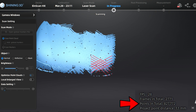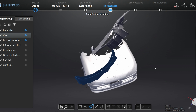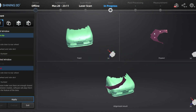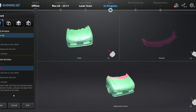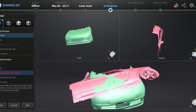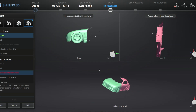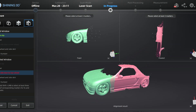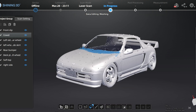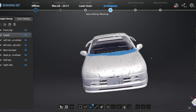In order to stay around that number, I removed all the windows from the scan data. With all the sections scanned, I'm left with a jumbled mess that I have to align. The software alignment feature is pretty great — 99% of the time it aligns automatically by features. Every now and then it doesn't do a great job, so I do a manual alignment by picking three marker points that the sections share, and it aligns perfectly. With everything aligned, I saved the mesh as an STL file, which I can import into Fusion 360 and start modeling the fenders in the next video.